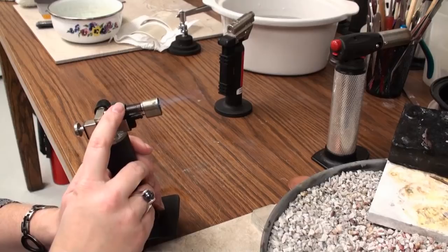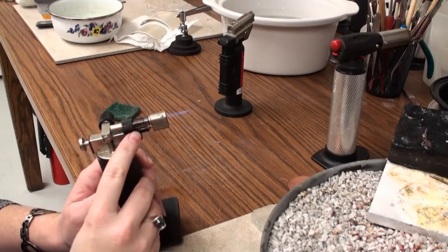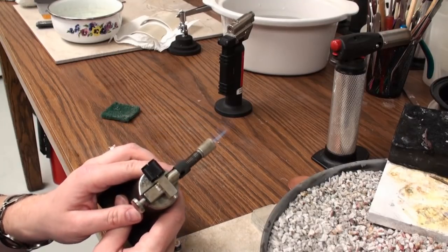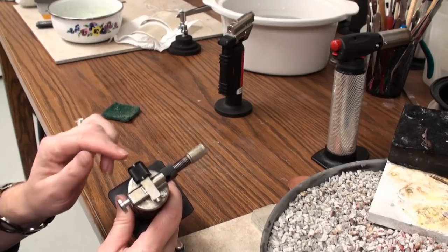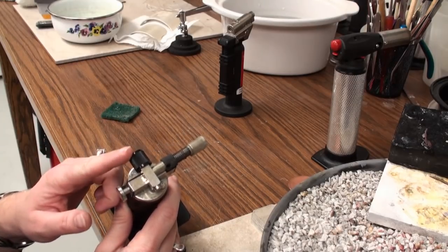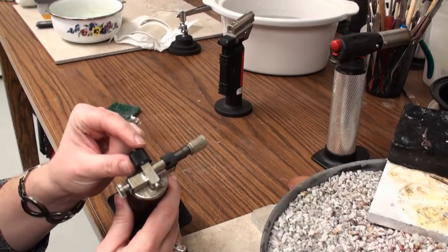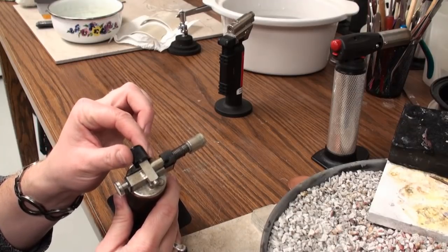There's no safety on the Blazer. To adjust the type of flame, there's a little round slider that you can twist to adjust the mix of oxygen to the butane. To turn your torch off, take this little knob and roll it back until everything turns off. Make sure it is tightly off and that you do not hear any gas flowing out at all. A lot of people think you'd keep twisting to allow more gas out, but it doesn't work that way — this knob is basically just on and off. It doesn't give you more gas if you continue to turn it.